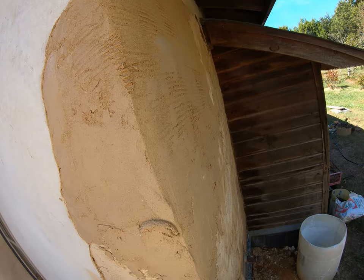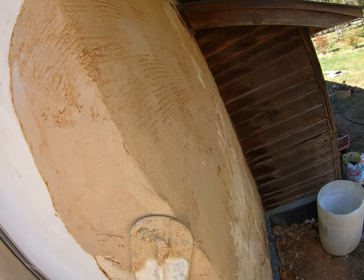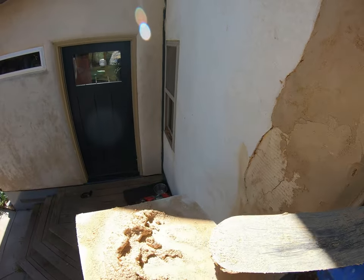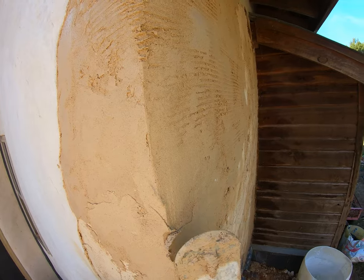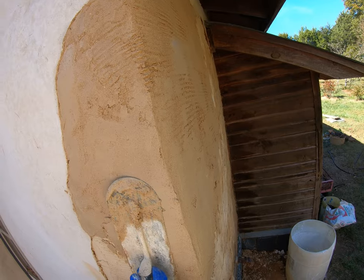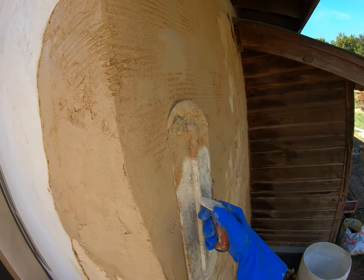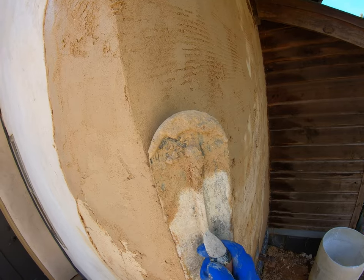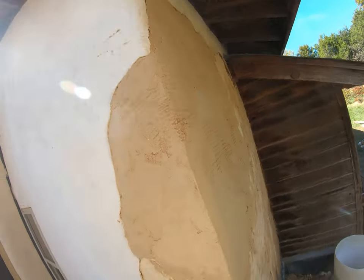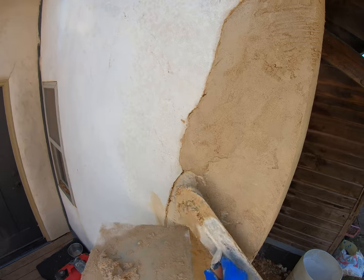Oops. Build that out a little bit. Oops, man, I'm getting sloppy here on camera. Just fill that back up, no big deal. And then just kind of work it from both sides. That is what I like to do for a corner where we are not putting molding. And then I'm going to come back and scratch it up, to receive that final coat.